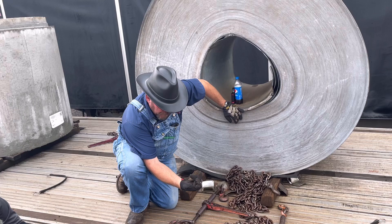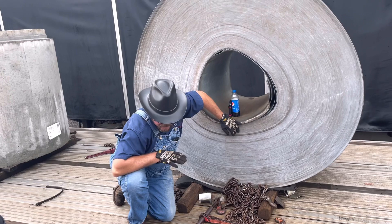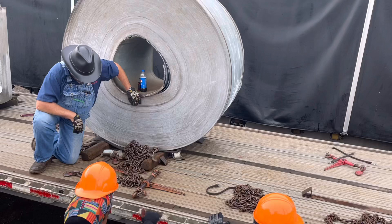It's through it though — you said already once on the hook. You can come up through it and hook, or you can come up on the back side of the hook. Either one, it does not matter. I just can't take a strap through there — a strap won't go through that. So for this one, basically 26,000 pounds, you're going to throw three chains at 6 o'clock, 9 o'clock time.